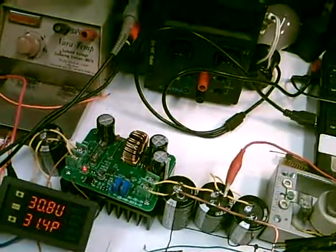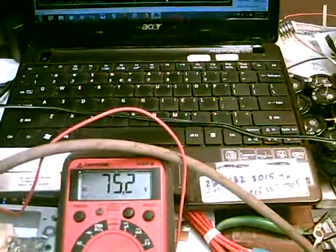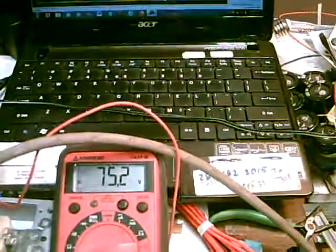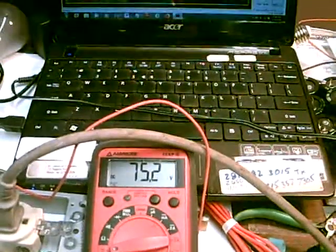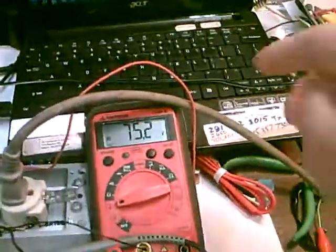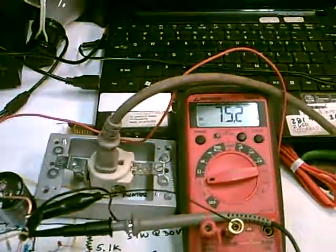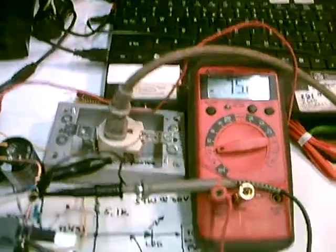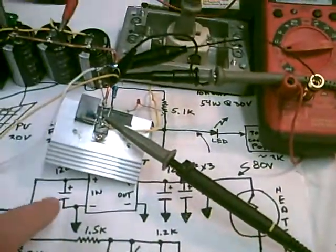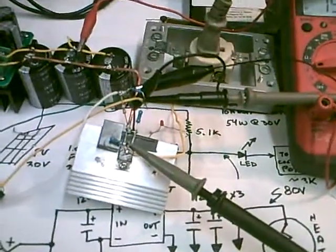What we do is we go in directly from the panels to run the boost inverter, and the boost inverter comes out to these capacitors, and it keeps them at 75 volts all the time. I had a 75N75 for a FET, and I put that in there. That's why I've limited it to 75 volts. But this boost converter stays operating all the time, and we only change the load by gating the FET on the output into the water heater.